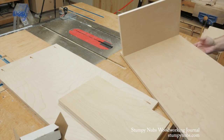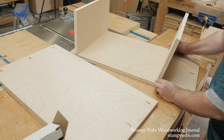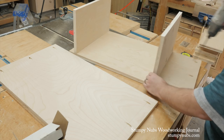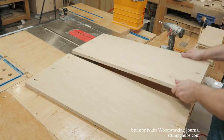I don't even glue my pocket joints. The screws themselves are far stronger than the glue on the edge of a piece of plywood. And if I make a mistake or decide to change something later, it sure is nice to be able to disassemble a joint by removing the screws. I'm not saying that you should use pocket screws in every project, but I am using them more and more on my shop-related projects like this one.